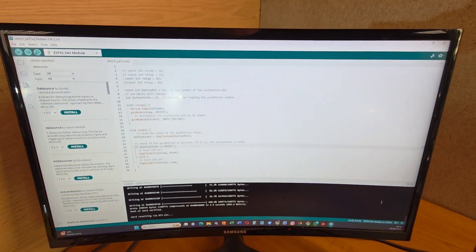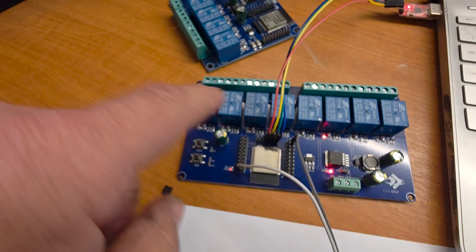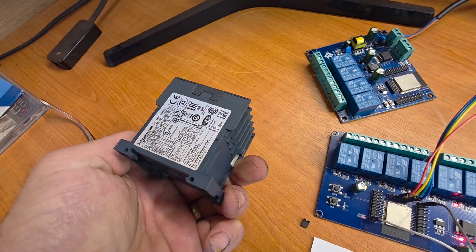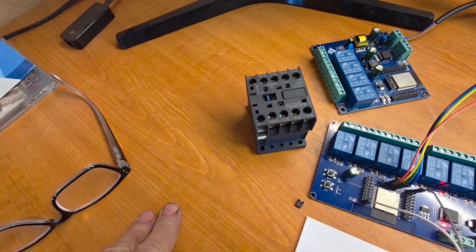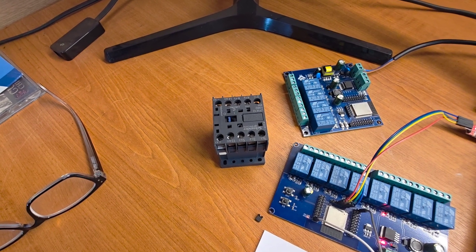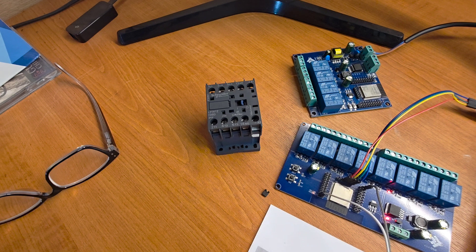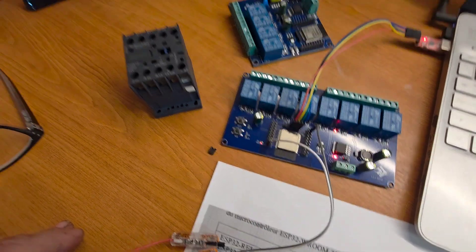Hence I needed some more paracetamol. You can see I'm messing around using the Arduino IDE 2. I keep trying to use VS Code but I just don't seem to get on with it — this is simple and does the job. So the plan is to use this. The relays are going to be to control contactors. Used in pretty much all heavy industry — industrial control systems nearly all use contactors to start motors, stop motors, with sensors going into them. You've got your A1 and A2 legs, which is the low voltage coil that then activates the large coil. You can fire up massive machines with just one of these and a little ESP32 3.3 volt. They are awesome.